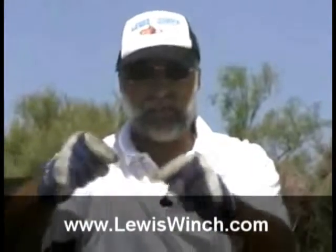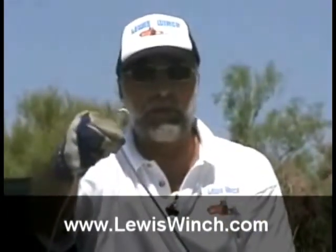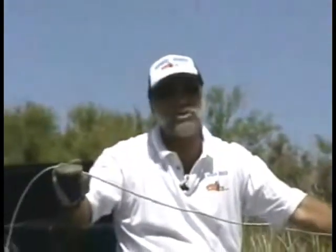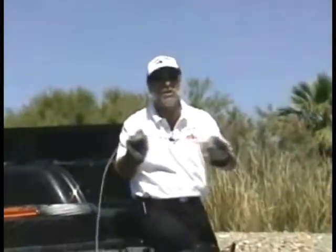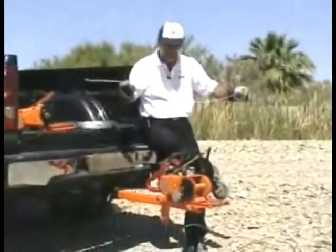And it's not that easy to kink, but if you do get a kink, and I did put a little one in the cable there, you create a weak spot. It can actually break some of the fibers, and it's not as strong as it was before. So you want to be careful, and you want to check your cable regularly over the years that you have your Lewis winch, and make sure that there aren't any kinks or frays in the cable where you think it might break, and if that's the case, you better replace it.